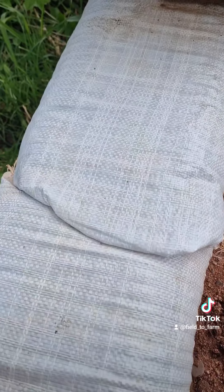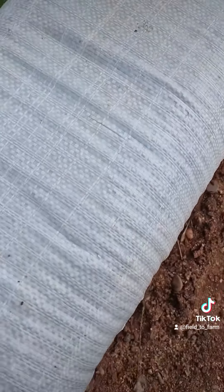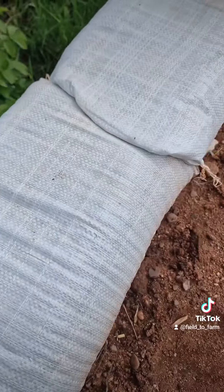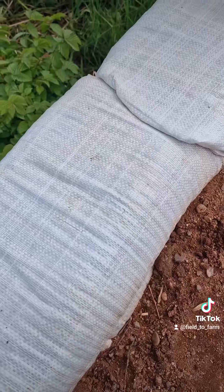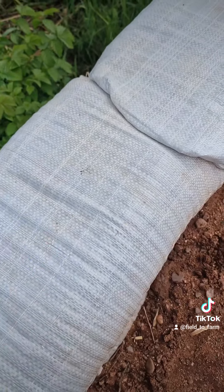This is more detail in some of the build videos I did on the roundhouse, but if you're doing higher walls and you want them to be stronger — basically if you're building a structure to actually use rather than just a wall — you're going to want to put layers of barbed wire in between each bag row. Basically you're just running barbed wire all the way along the top of a bag, using bricks or whatever to weigh the wire down, and then you put your bag on top of the barbed wire, and that acts as a Velcro to stop any lateral movement.